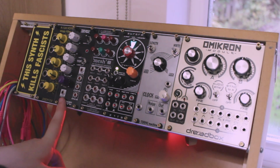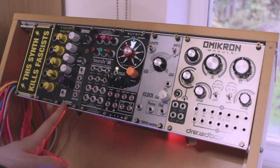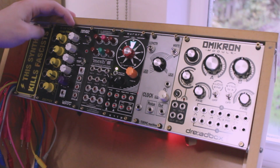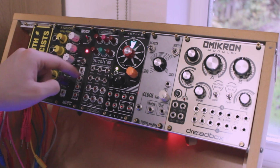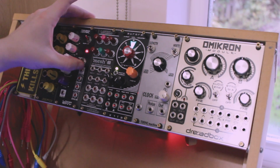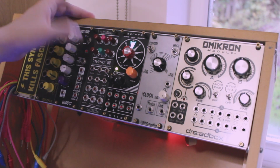The next one was this, the Frequency Central Looping Envelope Generator. This I bought the panel and the PCB off the Frequency Central website, then sourced the parts separately online and built it myself. I've got a video on it, you can look in my channel. It's just a standard ADSR, but you can set it up as an ADSR or you can loop it. You can see it looping on the LED there, or gated loop, so it'll loop only when a gate's plugged in. So they're all useful.